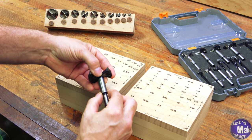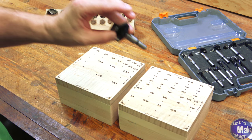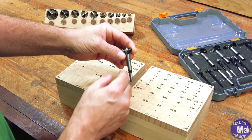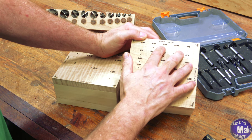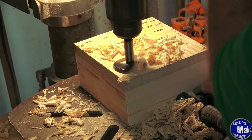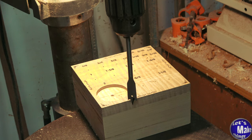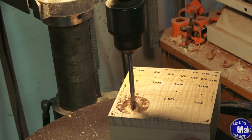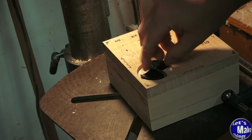I'll drill down and then drill out the rest of this larger size. The larger size for this bit is a little over half an inch, so I definitely want to go a little bit bigger than that — I just want this to be able to slide in and not fight it. Now when I get down to the smaller ones I won't use that half inch size; I'll do it accordingly to make sure they slide in and don't fall into the second part. While I use Forstner bits for this side, on the other side I'm going to use a set of spade bits, and all the markings up here I'll be using brad point drill bits. It's also important that you lock your table, because your table will actually drop down and give you a different angle if it's not locked. My first one fits all the way in and it's easy to pull out.